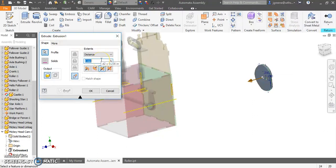Also made it at 6 millimeters. The reason for that is I'm going to put 2 of these cams on my laser engraver sheet, and then I'm going to glue them together. That gives me extra surface area for my roller to actually roll on. It beefens it up a little bit so they're a little bit less wobbly. So make sure that's 6 millimeters, make sure it's symmetric.